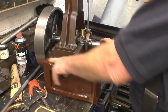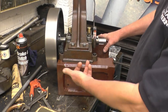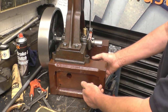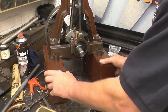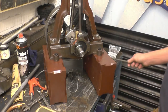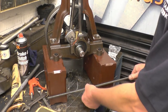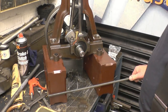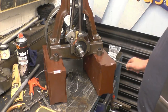Make up the wood machine for the bases, all nicely scalloped out. I've got a hole through there so I can put a bar through to help lift it. I'm also going to put some supports through there in between the two pieces of wood. I've got some UNC stud and I'm going to put that through there with a tube in the centre. Hopefully I can put a tray in there as well to collect the oil which inevitably drips out — because it is a total loss lubrication system.